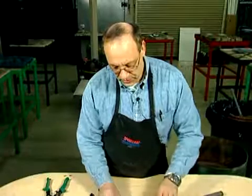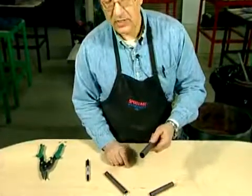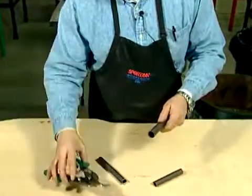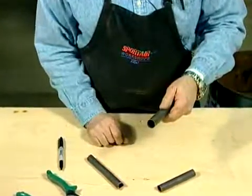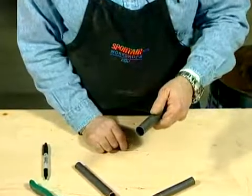I've got a piece of tubing here. Most of your aircraft tubing is 035 and 028. I wouldn't recommend using this method on tubing over 049 — it's hard on the tin snips and it's hard on your wrist. So we're going to work with 035 right now.